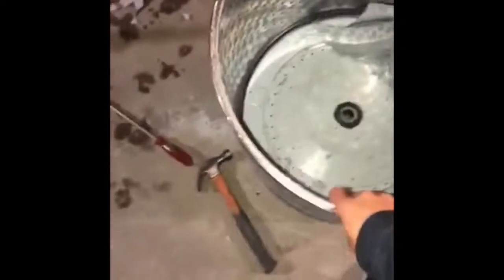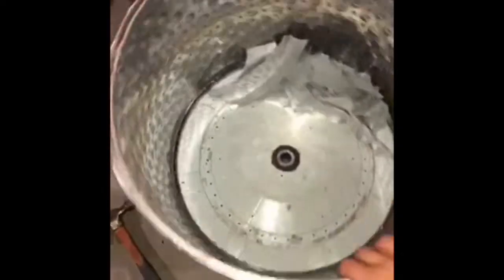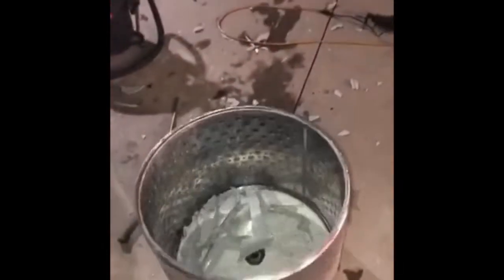So this turned out to be a bigger project than I expected. This is supposed to be a fire pit — it's better than my old one, which I also made from a washing machine, but this one's way bigger. The problem is the bottom is plastic, so I'm gonna have to knock all this out. It's crimped really tight. I'm gonna cut a circle out of that metal, weld it on, bolt some legs, and then we'll have a fire pit. It's gonna be a nice big shiny stainless steel fire pit with all the air holes.